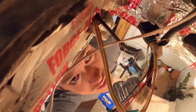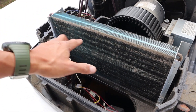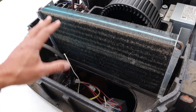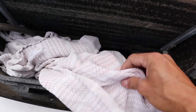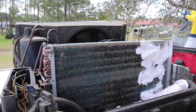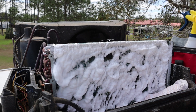Some nice grime up there. I was worried we were going to have some mildew — it doesn't look like mildew or mold, but it's still pretty dirty, so let's clean that off. Here's where the coil cleaner comes in. We're just going to spray the coil cleaner on, but we don't want to soak the bed down there, so we're going to shove a towel in this space so we can gently rinse this off. If there are any coils that need to be straightened, we can use a credit card or a plastic knife to bend those back into place. We're carefully taking this thermostat out, setting it aside, and putting the towel in — being careful not to bend any of the AC coils. Thoroughly saturate all the coils in the foam and then let it sit.